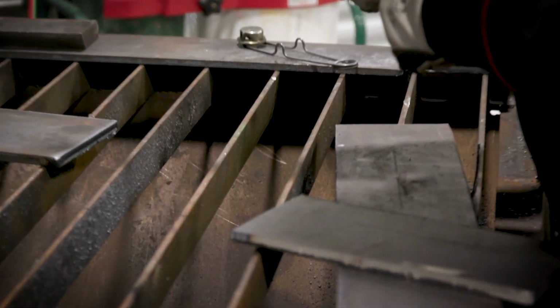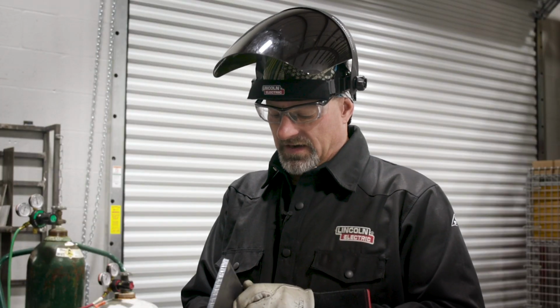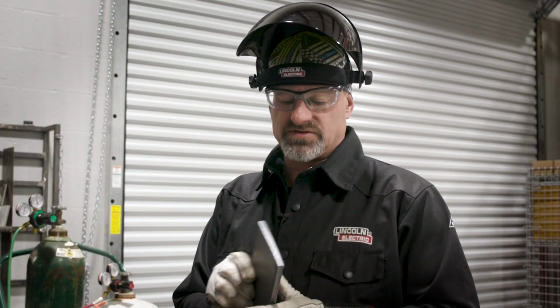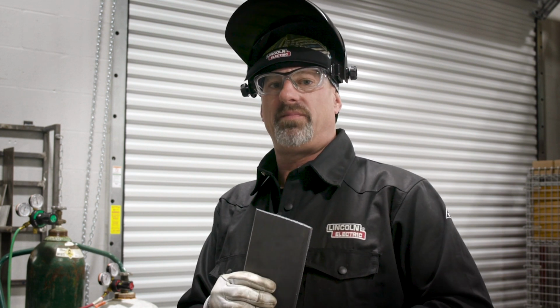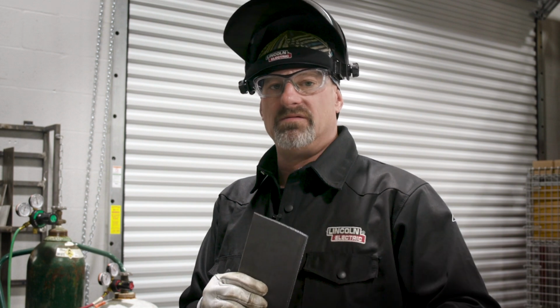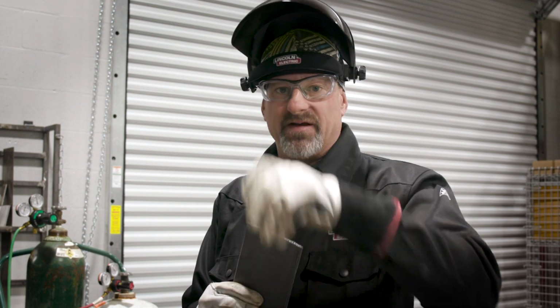That's pretty. If you preheat it correctly, you take your time, your speed, and everything with your hand coordination, and you keep really consistent, you can come up with some nice quality cuts with that, just using propane. And the good thing about propane is you can get it at Home Depot, Walmart, the gas station, if they got propane tanks out there for sale. It's everywhere, and it's cheap, and it works. You can definitely see that.